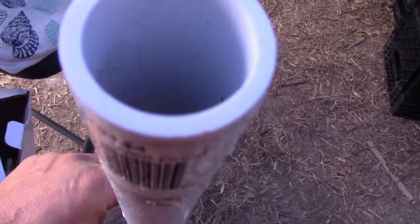There are different ways to do shallow wells. Kind of popular on YouTube right now is just driving it in. And you can use something like this. It has tiny little gills. I don't know if you can see them. What they do is they actually take like a sledgehammer and hammer these things deep into the ground. And it pulls water in it. You don't have to buy a casing.